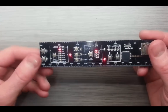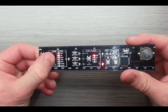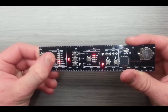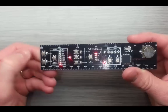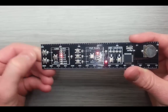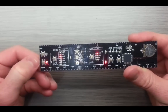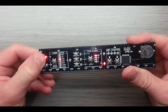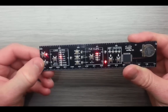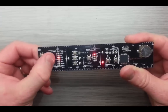Over on the left-hand side we've got logic gates. You can select between different ones with this button: NOT, OR, AND, XOR, NOR, NAND, XNOR. And these two buttons set the inputs. For example, if I go to an AND gate — 0, 0 gives an output of 0; 0, 1 gives an output of 0; 1, 0 gives an output of 0; and of course 1, 1 gives an output of 1. You can do it for different gates.